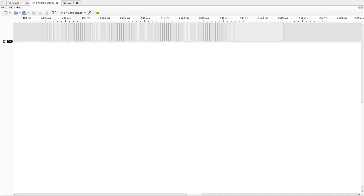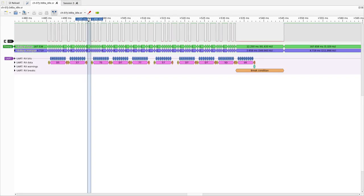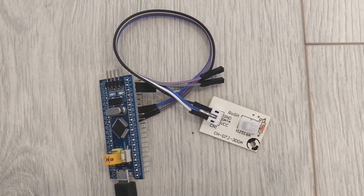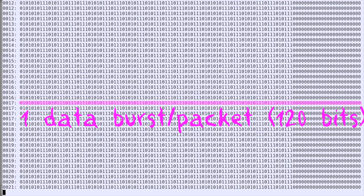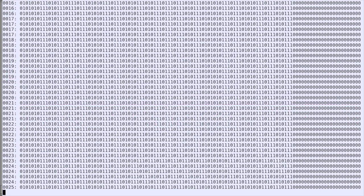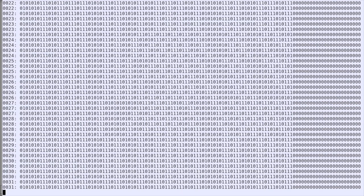Step three: decoding. We need to understand how the transmitted data is formatted. We see a common small pulse of 500 microseconds, and other pulse durations are multiples of this — but it doesn't look like classical UART. Using the development board to decode the bitstream, we find transfer packets of 120 bits, which is odd because it's not a power of two. Increasing the humidity by blowing on the sensor shows no clear format in the data — time for a small break.